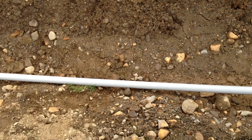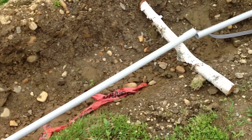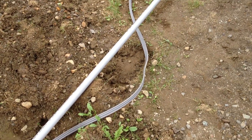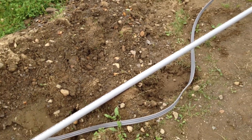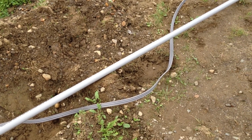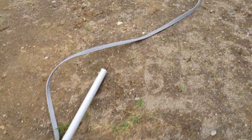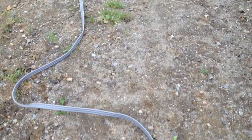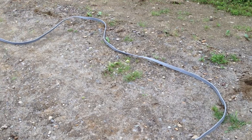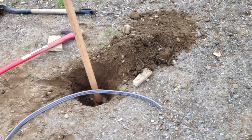So I have Schedule 40 one-and-a-quarter inch PVC for the conduit. I also have Romex 8-3 UF for the electrical wire, which is the direct burial and more expensive version of course. According to code I can direct-bury this wire at 24 inches, but I'd rather just do it right the first time and have some conduit, so if I ever need to pull something through or replace this line it'll be much easier than retrenching.